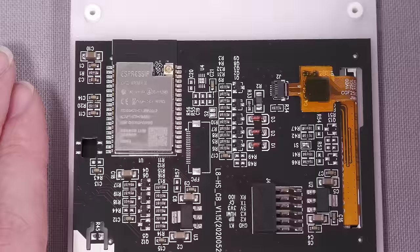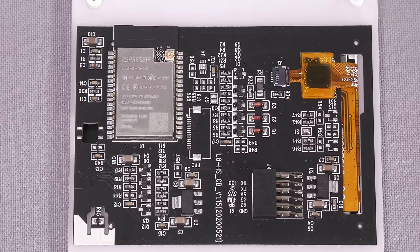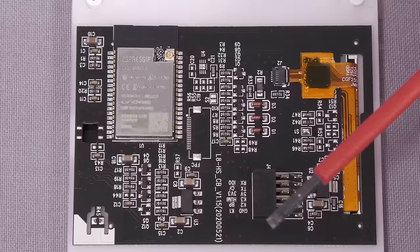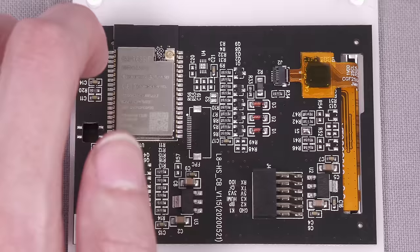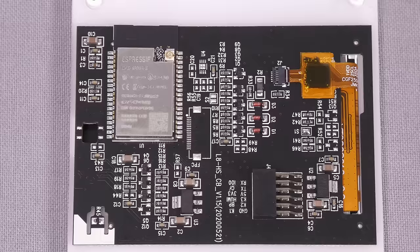You've got the SPI LCD connected over an SPI connection with power, a few RGB LEDs around the outside that glow through the casing, a big pin header that connects to the power supply board, and then the main chip of significance is an ESP32-WROVER-IB module. This is a very common chip — it has an ESP32 CPU handling all the Wi-Fi, you can flash firmware onto it, it has built-in Wi-Fi with a connection for the external antenna, and a ton of external GPIO. Some GPIO is used for relays, some for SPI to the LCD, and some is broken out as a serial connection to the pin header for flashing.